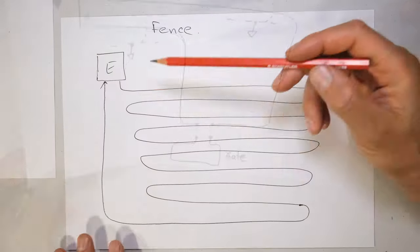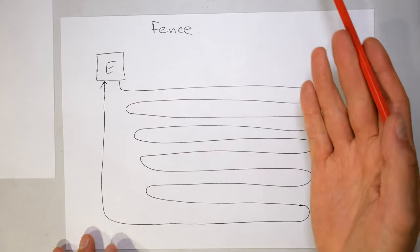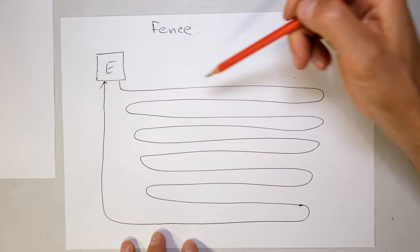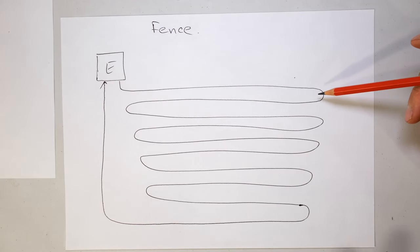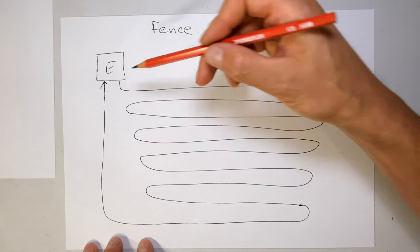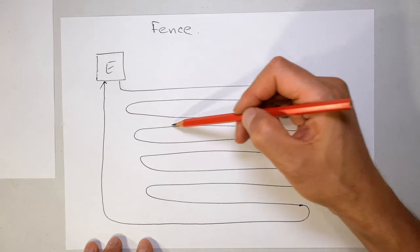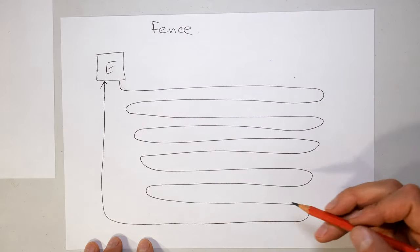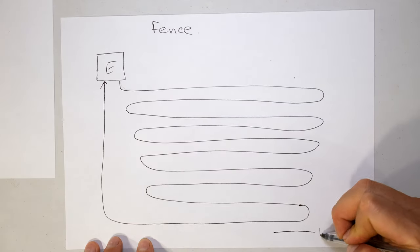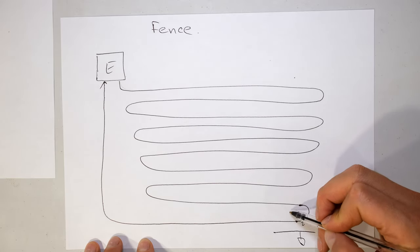Here's the fence. These are the wires running all along the wall on the upright poles. I haven't numbered them because people like to put the live and the earth in different sequences - I'm just going to show you the principle. The principle is that the live wire goes around your whole property. You might decide you want to put your earth wire as number one, so that would be number one for earth. Then number two, and number three you want your earth again.